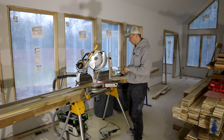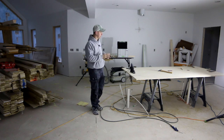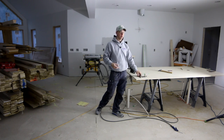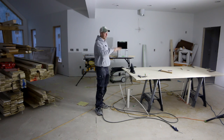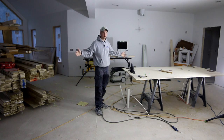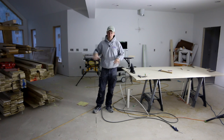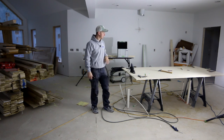Now for the assembly table station. This is a really big house — I have no idea how many sets of casing I've assembled, but you would not want to do all that on the floor. I just take a sheet of plywood, throw it down, and that's where I put everything together. Really large pieces I'll do on the floor close to the opening, but probably 90-95% of my casing sets get assembled right here. Look at where I'm working: material, saw, assembly — not wasting any footsteps.